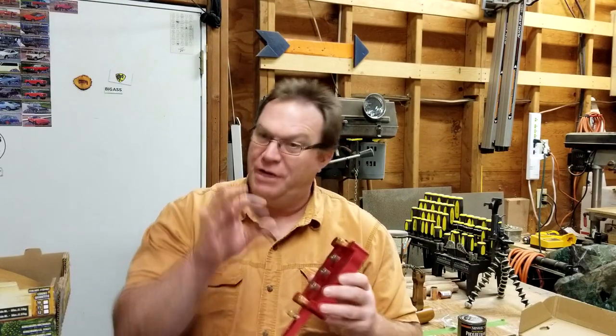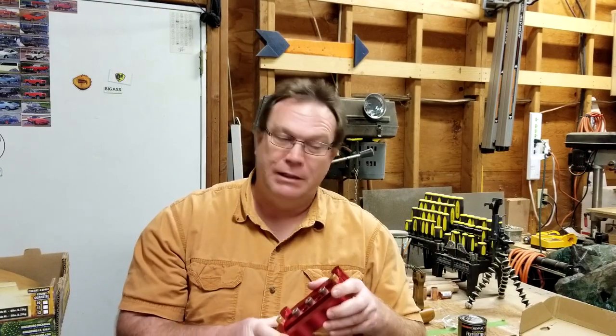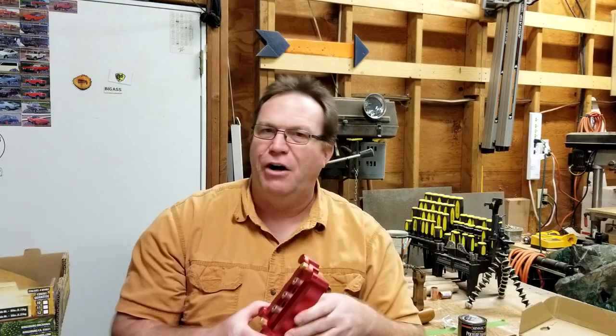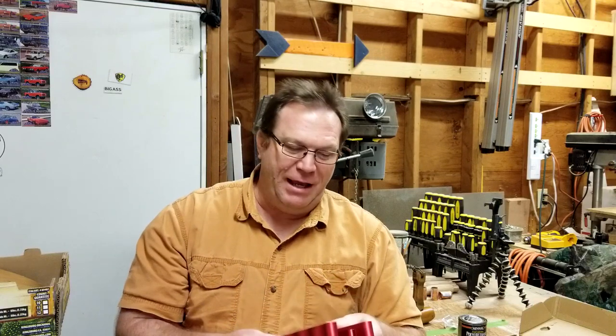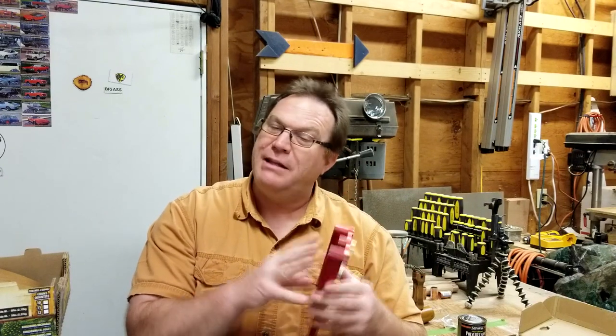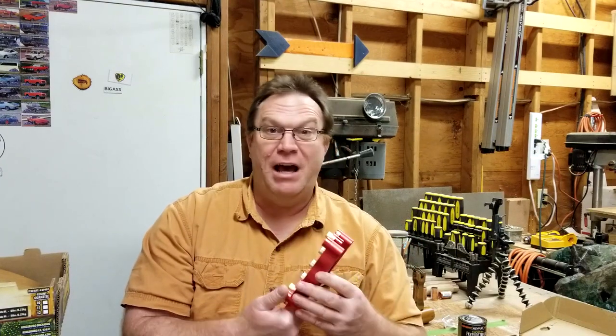I did my best to force it flat. On one or two holes I even had to pull out the dowel and not use it in order to get the boards somewhat level. I even went over it with a hand plane. I don't have a thickness planer yet — that would have been the best bet; it just would have been thinner but perfectly flat. So that's something to keep in mind if you get this tool: make sure all of these screws are tightened. It's kind of weird because each one of these screws has a spring in it to help keep tension so they don't come loose — apparently this one had not been tightened all the way down.